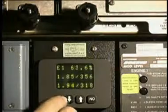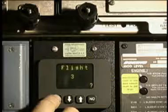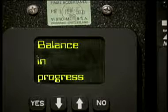Once the X flights display question screen shows, push and release the yes button. The next screen gives us the imbalance solution for each flight or trim balance run — there will be up to six flights or trim balance runs in the system. This display will provide us with the fan balance weight solution in inch, gram, centimeters; the fan balance weight position in degrees; and the flight numbers zero through five. Note that zero is the last flight leg or the most recent ground run. Next, push and release the yes button — this will cause the balance in progress screen to show.